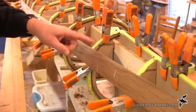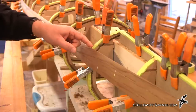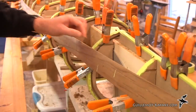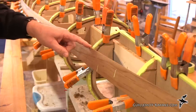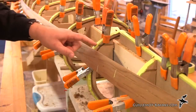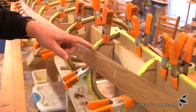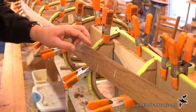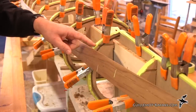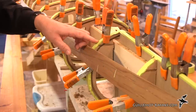After stripping off the tape and unclamping the brackets, I came by with some hot melt glue and checked if any of these strips were loose on the forms and put a little dot of glue under them. I was having some trouble with my hot melt glue — it didn't seem to be sticking well to the forms, so I switched to a different stick. If I continue to have problems with hot melt adhesion, I will just strip the green tape off and glue directly to the forms. It makes things harder to release but at least those strips will stay in place.